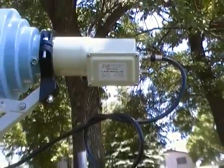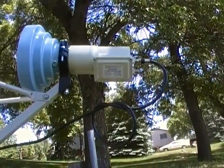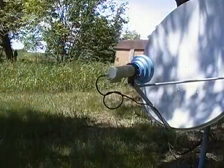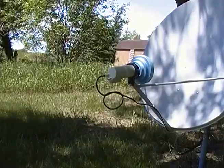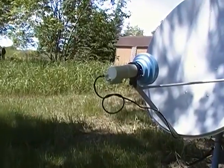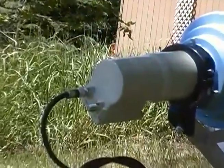Both outputs set both polarities as expected. Had I spent any time to tune the LNB in scalar, performance would be virtually identical to the 421. Unlike other knockoff LNBs, the BSC-422 has a true 13K noise factor and a real 65 decibel gain.